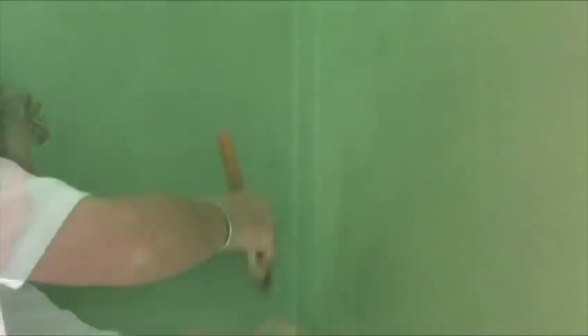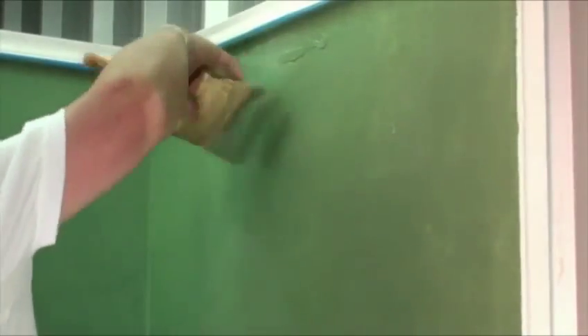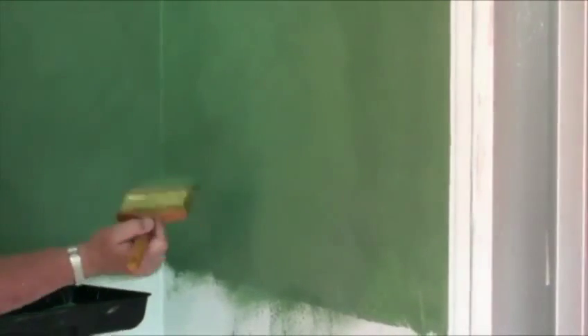Check your work as you go before you leave the area you're working in — you can't touch up once the paint is drying in the area. Remember, stroke up and hook to the right this time; this ensures your edges and corners have a smooth look. The Wattle Suede effect is a bit thicker than ordinary paint. Stand back from your work often so you can have an overall look, and try to keep your cross application a similar size throughout, always overlapping.